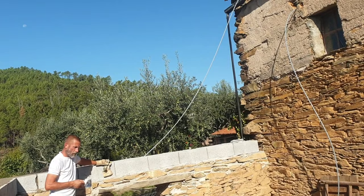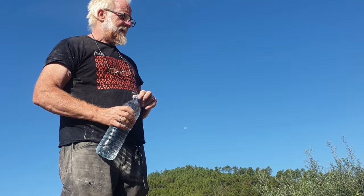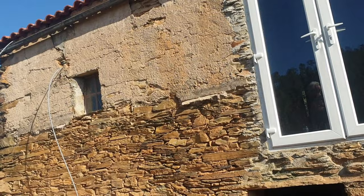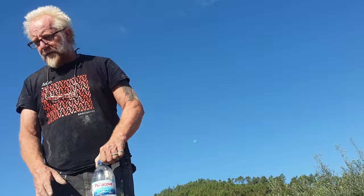You'll only see really a line, a gap where it joins together - just one line. You'll see all the bricks underneath, all at the same level. How would they normally tidy that up afterwards from the underside if they're fussy? Plaster it. Oh, they do plaster it, do they? Or you can put plasterboard up. Yeah. It's just getting a roof on it for the time being, isn't it - that's what we're bothered about. Once the concrete's poured over the top you won't see anything.